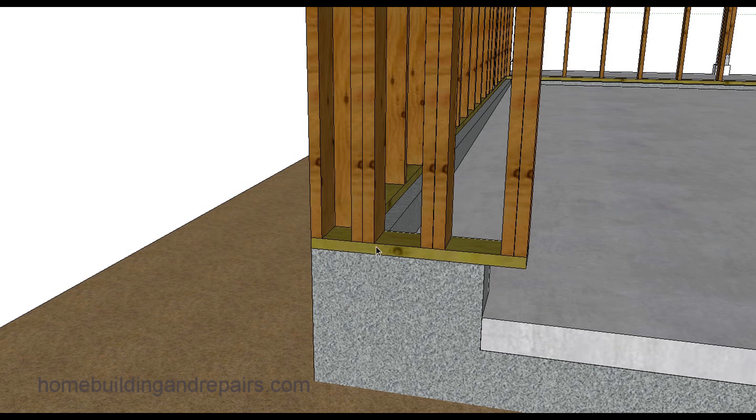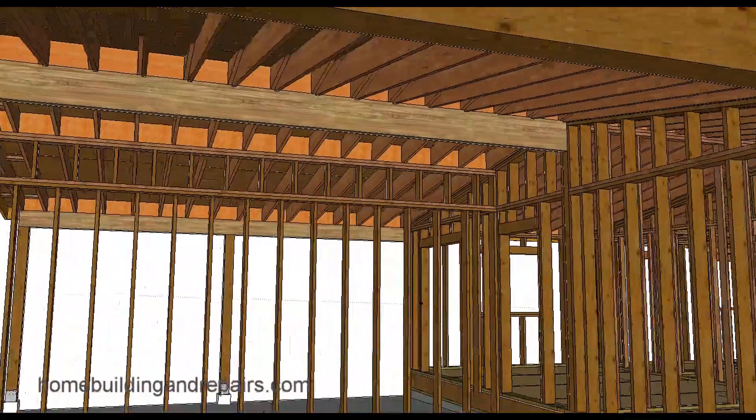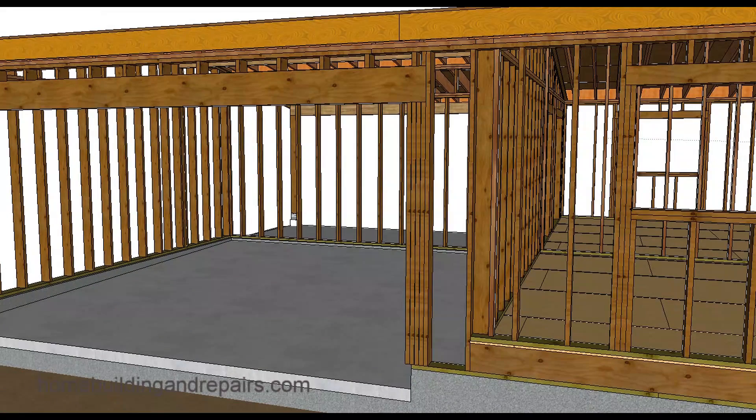If the beam is sticking over a little bit, the trimmers here aren't going to be supporting it, but these will — so you'd have two supports, and you can always put one underneath. You'd usually notice this when you're laying out the home, starting with a concrete foundation and getting ready to install your plates. If you're only a little bit off, like this one where one trimmer is not on and the other is about half on, you can extend the beam over a little farther and pick it up with two trimmers.